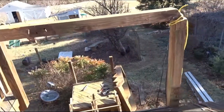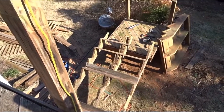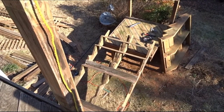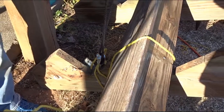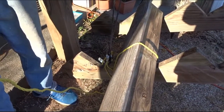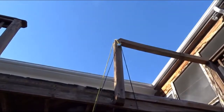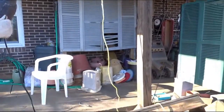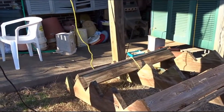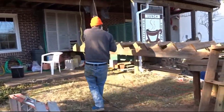We've got a pulley system rigged up now, so we can raise the stairs up. We have a pulley here, and we have one single rope, but there's 2 sections of rope connected to the pulley, and they each carry half of the total weight. And then one side of the rope continues on to a second pulley, and half the weight continues to a second pulley, so it's easier to lift, but you have to pull the rope twice as far to lift it. I can actually hold this with one hand. Oh, okay.